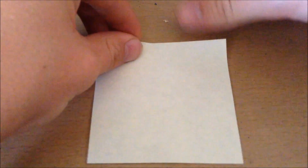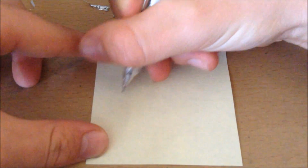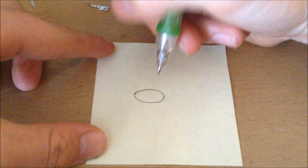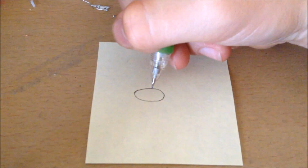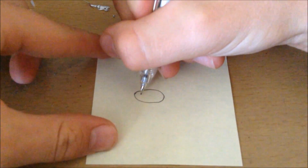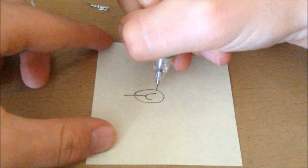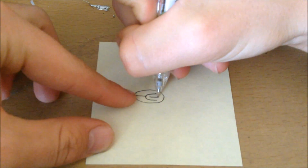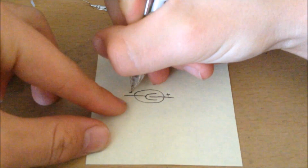So to start, I'm going to explain to you how a Geiger counter works. Pretty much, a Geiger counter is an evacuated tube full of an inert gas, such as neon, helium, or argon. And inside this evacuated tube, which is at a very low pressure with this gas, it has two electrodes. One of them is shaped like a little barrel, but in the schematic it's shaped like a horseshoe. And inside it there's a thin little wire. This part is the anode, and this part is the cathode.